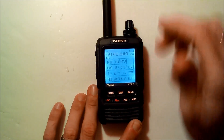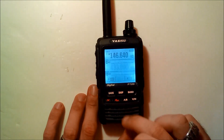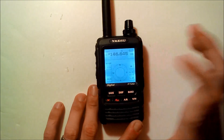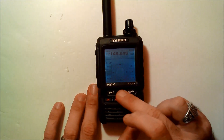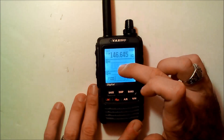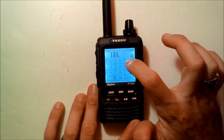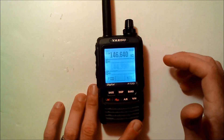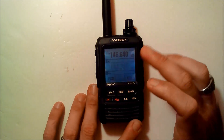Back in the menu, there's a bunch of familiar features. That's where your GPS location is — you can see your position and as you're talking to somebody, where they're at. You can switch down to the bottom band, do direct frequency entry there too — for example, 144.390 for APRS FM — and then set that band to digital mode. I really like the touchscreen feature. You can go from memory to VFO mode, set your tone and repeater offset, and you're good to go. The easiest way to set everything up is through the free programming software on the Yaesu website.